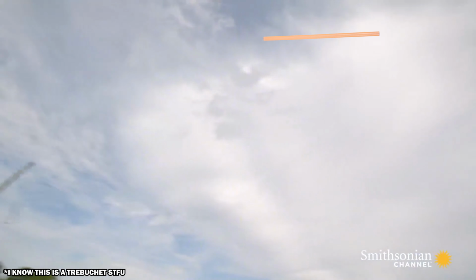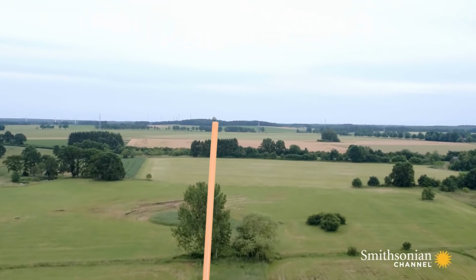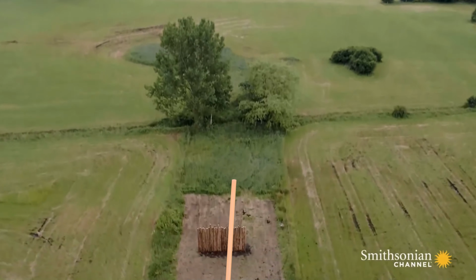Now, one idea would be something like a catapult, where you have an arm that swings forward with the straw mounted on the end. It releases when the straw is pointing straight in the direction of the motion so that it can then launch the straw out. The issue with this is that due to how light a straw is, you're wasting most of your energy just accelerating the arm of the catapult and then stopping it, while the straw takes a very small portion of that energy with it. This leads me on to another potential idea.